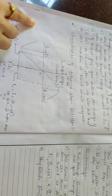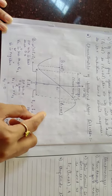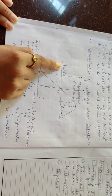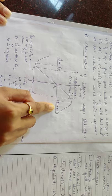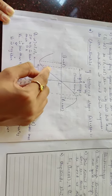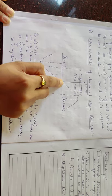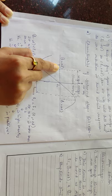The characteristics of the balanced slope detector, also called the S-type slope detector, can be seen here. fc is the center frequency, fc minus Δf is adjusted on the lower side, and fc plus Δf is adjusted on the upper side. The useful range is where it is linearly increasing, and at fc plus Δf it is decreasing. Similarly, with respect to fc it is gradually decreasing toward fc minus Δf.